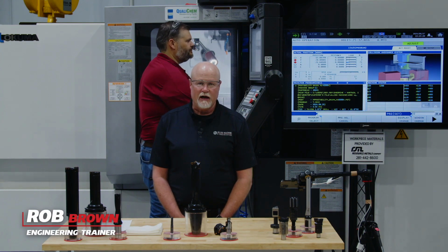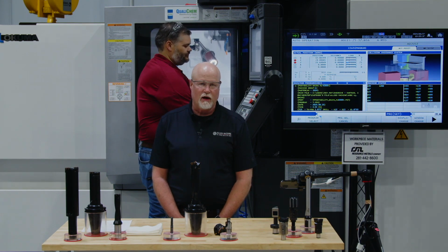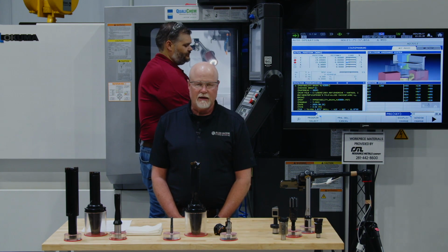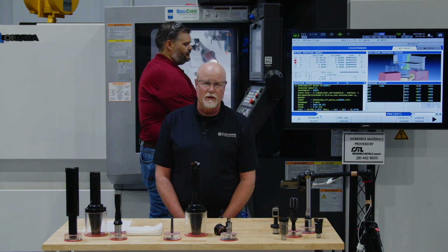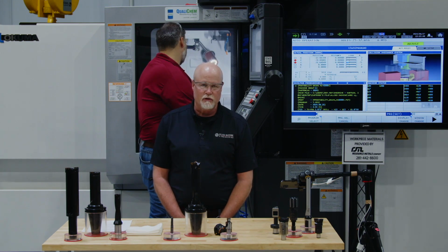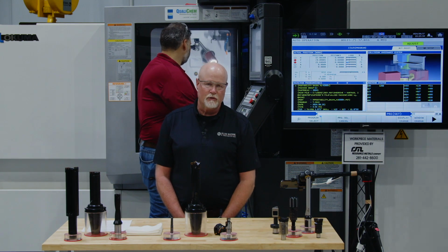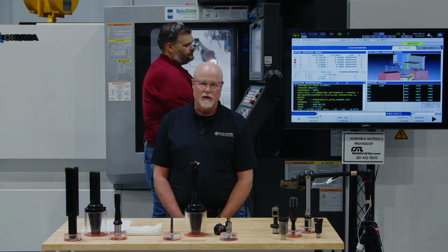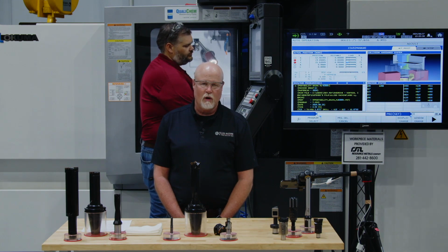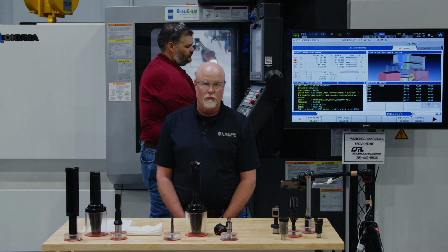I'm the engineering trainer here at Allied, and we're here today at HARTWIG down in Houston, Texas, running on an Okuma MU-6300V to show you a variety of different Allied tools in a material that can sometimes be a little bit of fun. To give you a little background, the machine is an MU-6300V, a 30 horsepower, 5-axis machining center. It has an external coolant pump supplied by HENNIG that can do 1,000 psi and 8 gallons a minute, and we're using QUALICHEM coolant in the machine to help us get the chips out of the hole.